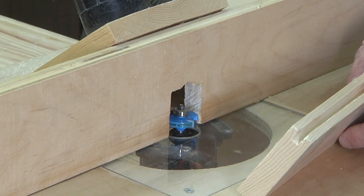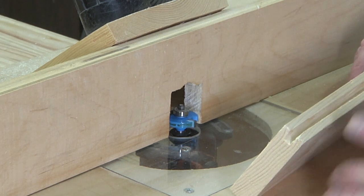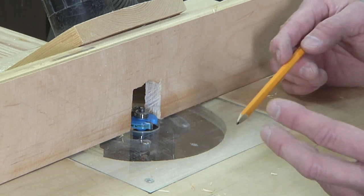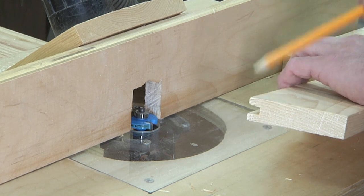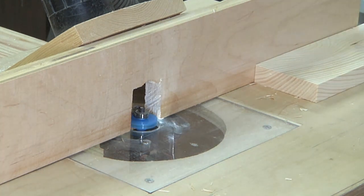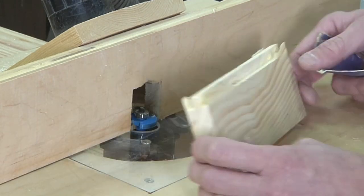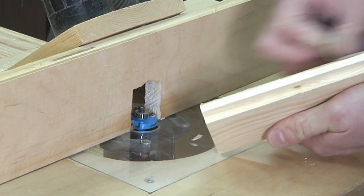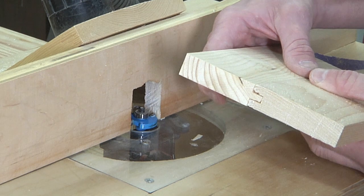There's the groove for it. Now I can also use the same bit to make the tongue. It's a little bit more setup, but it can be done. So let me set that up and show it to you. This took a little time to set up — I lowered the bit down and did a couple of practice cuts to make this work. What I'm going to do now is try to cut a tongue to go into this groove using that same bit. I've got a little bit of wood left on there. Now that comes off nice and easy. Let's test the fit. Nice! I have a tongue and groove joint now.